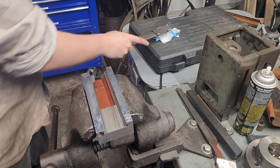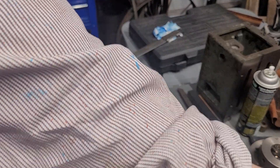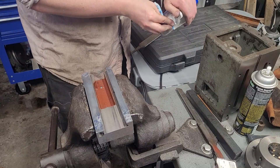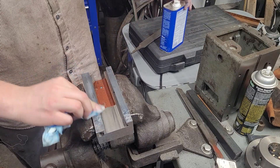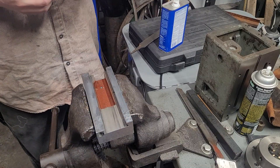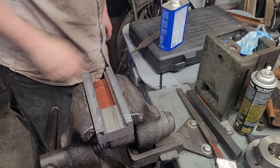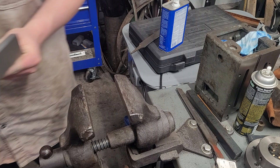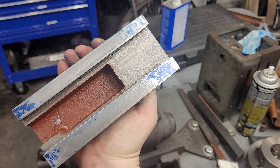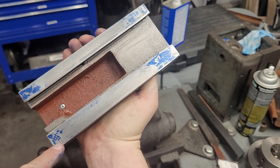If I can get contact spots over 50% of the surface, I'll be a happy camper — that's really all I need to see. This is not a top-dollar lathe, not a top-dollar machine. I'm only scraping the compound, not the cross slide, because as far as I can tell my flex is almost exclusively in the compound and the cross slide doesn't rock. So I blued this up again off camera — you can see the contact pattern just moves a little bit every time.